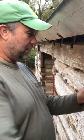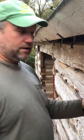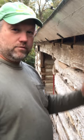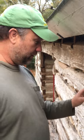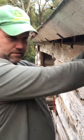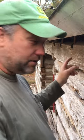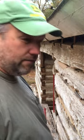Right before you start the next joint, if there's some splatter here, you can just scrape it off, do your next joint, and you don't have any worry about stuff falling down on top of it. So we'll start today up here at the top, do these top joints, and then I'll do all the way across, then I'll work this section down, then I'll get on the other side of the window here and work that section down, then I'll move my scaffold, and then I'll do all the long joints down the bottom that I can do standing right on the ground.